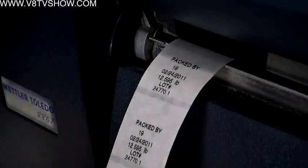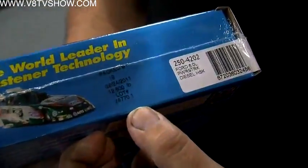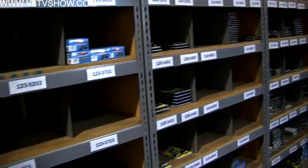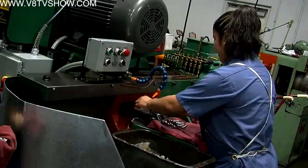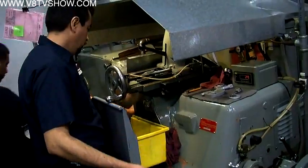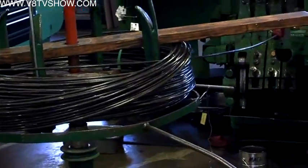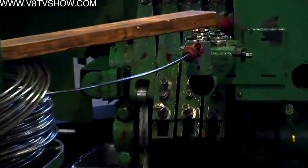What's the point of all that documentation? The primary reason is if down the road the customer has a problem or an issue with the kit, we can ask them to look at that number on the side of the box, and then we can trace back who built the kit, what components were used, who rolled the threads, who ground the part, when the raw material came into the plant, and which heading machine was used to form the part. So we can really see if something went wrong and trace back where it started.